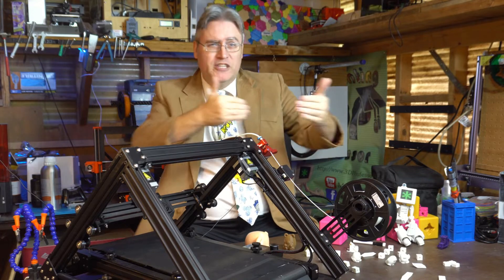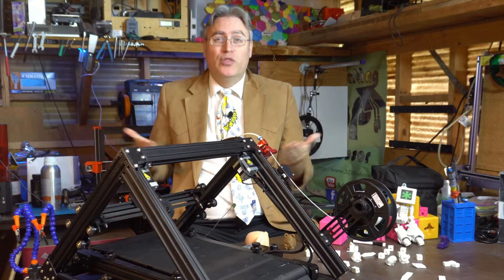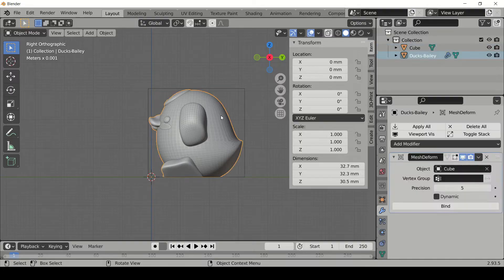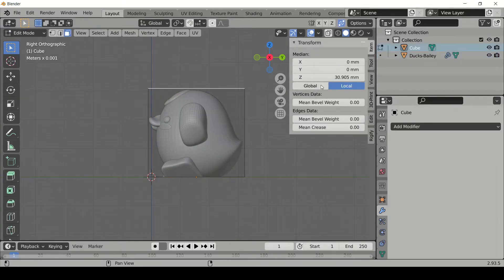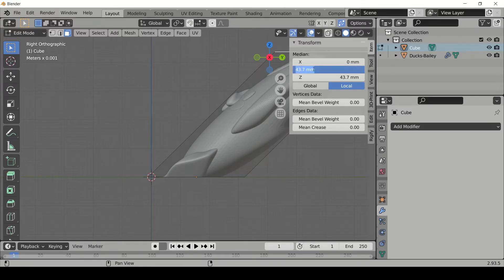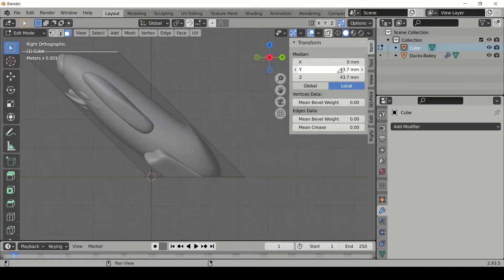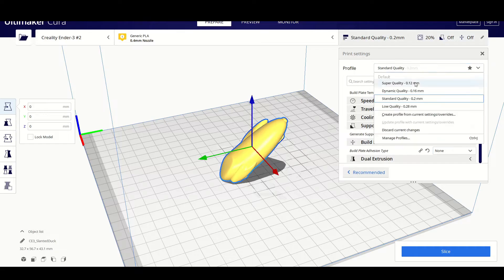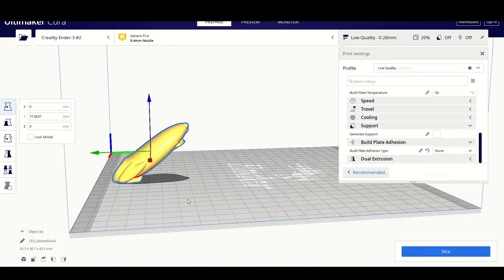When I presented this idea to people in the belt printing community, I got a lot of responses along the lines of: it's not going to work, there's going to be problems. But I decided to ignore the naysayers and just give it a shot. For my test print, I was going to start with a simple cube, but I had to take that cube and pre-slant it so that the slant of the print would correct it and make a straight up-and-down print. I took that cube and first scaled it up according to the scale factor, which is about 1.4 — so now my cube is 1.4 times higher — and then I made sure the angle was at 45 degrees by skewing it. Then you take it and put it in a regular slicer, load up for the Ender 3, just a regular Cartesian 3D print system, and slice that file.